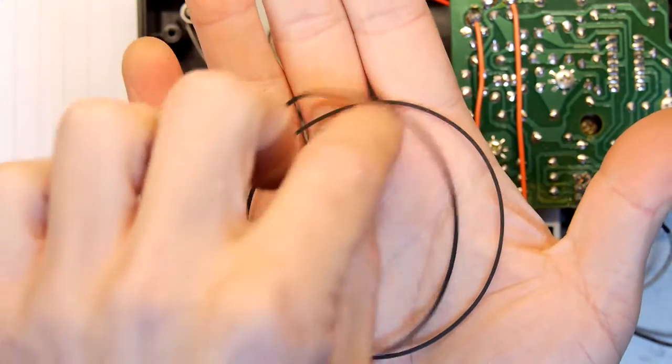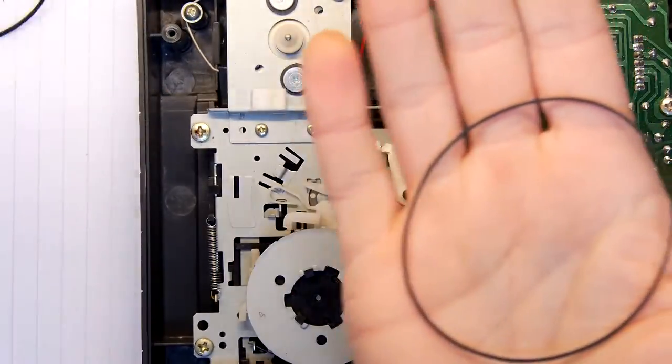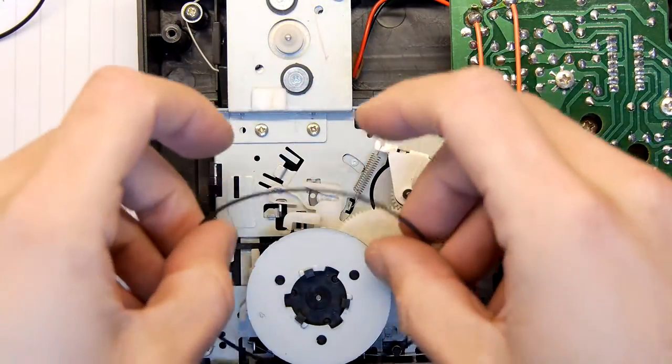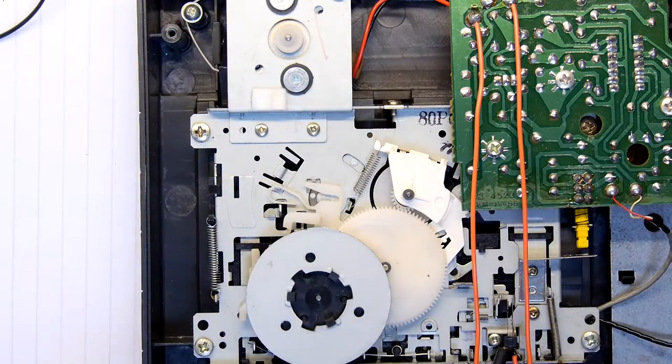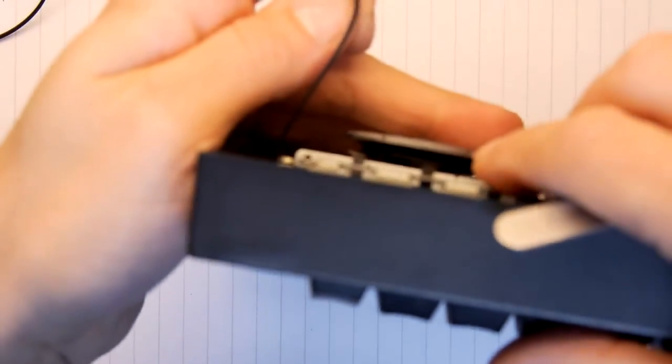But I guess it doesn't matter. It's this sort of diameter that matters. If you put a belt that's too small, you might get away with it for a while, but you'll put pressure on the bearings, and that's going to be bad news for your unit in the long run, and bad news for you, because where are you going to get spares for that?